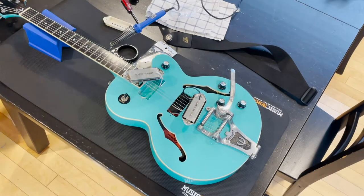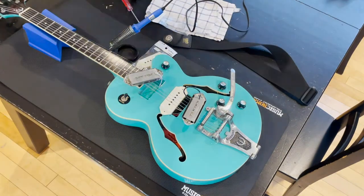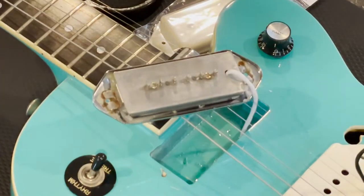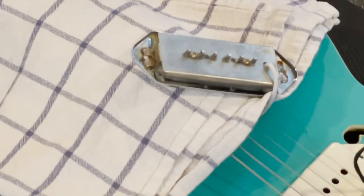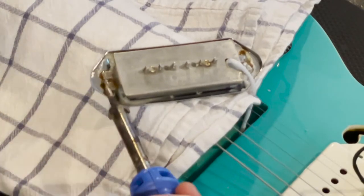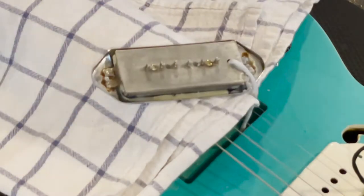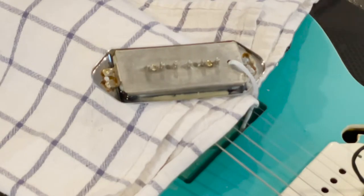The first step is you've got to desolder the pickups from the pickup cover. This is something you're going to have to have a good tool for. You're measuring to make sure the holes are the correct width. I've heard of people trying to put in different dog-eared P90 pickups and they just don't fit correctly, so I was very happy to see that these fit. I tried the suction device — that didn't do anything. I tried using the copper braid and that worked a little bit, but then I ended up soldering it to the pickup and having to keep pulling it off.